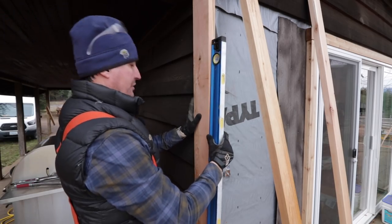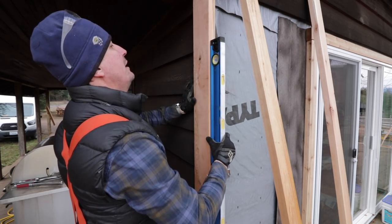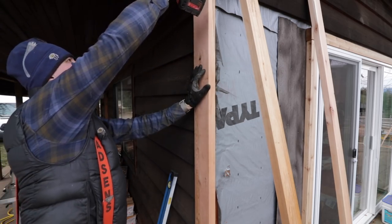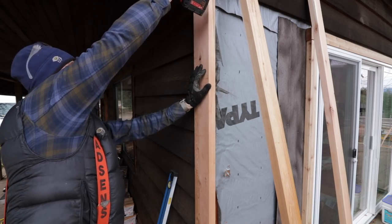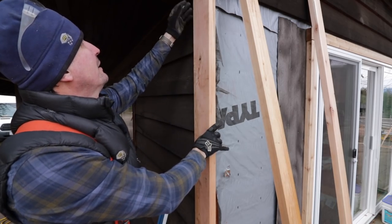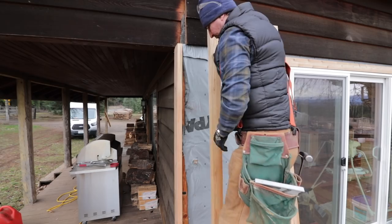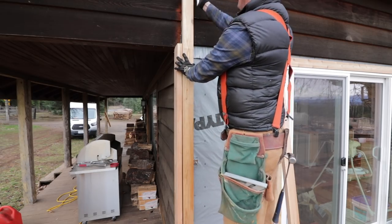Even though the house is crooked, I just can't build crooked. So I'll level this and tack it in place because I need to use it to figure out where to cut the next piece. Cedar does have a tendency to split, especially on the ends, so I'm going to pre-drill — an eighth inch is usually a good size to pre-drill for large nails — at kind of an angle to toenail it in there. We'll need to take this off again to recut it once we know where it's going to be, so we don't want to nail it completely securely. Now that we have that corner established, we can put our second corner in here, which gives us a guide for where to cut our siding back so it runs right in there.